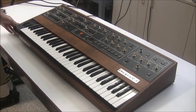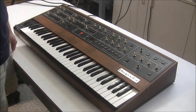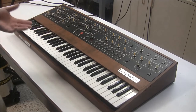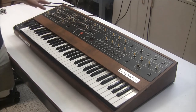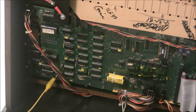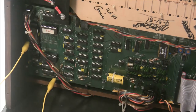This is a revision 3.2 Prophet 5 — I can tell because when we had it open it says so on the circuit board. If it were revision 3.3 there would be things cut and jumpered and a later ROM revision. The revision 3.2 has a self-diagnostic test that may help us narrow down where the problem is. Unfortunately you can't activate it by pressing buttons on the panel — you have to jump something inside. So I'll open this back up and show you what we need to do.